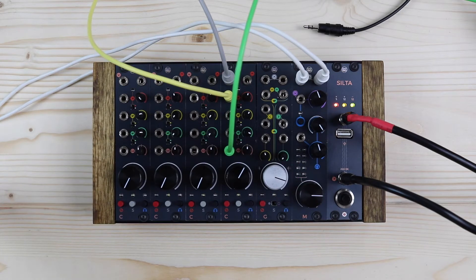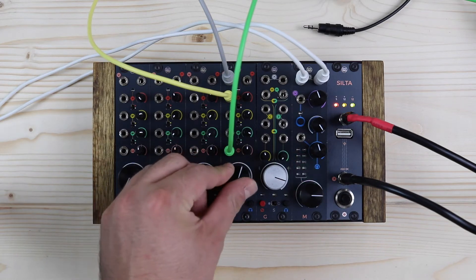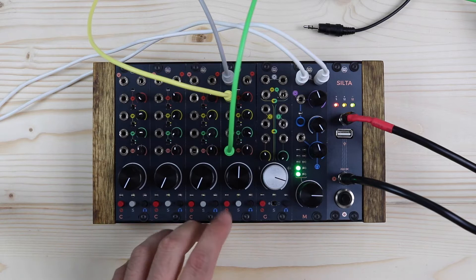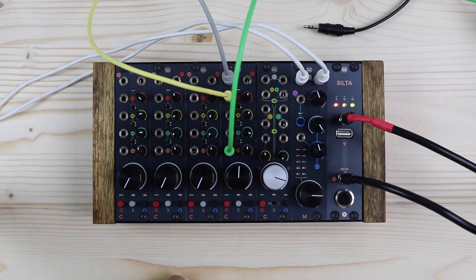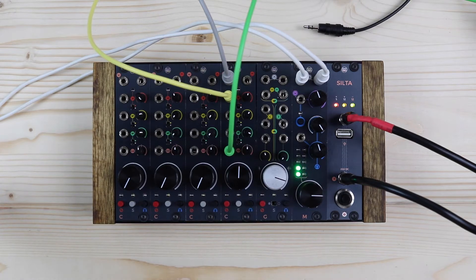Control voltage range goes from -5V to +5V, where -5 is left, 0 is center, and +5 is right. The big knob on the bottom is the fader and manages the volume of the signal which is sent to the group, as in any other mixer. The three buttons on the bottom of the module, from left to right, are the mute, the solo in place, and the PFL. The mute shuts down the main VCA, while the PFL only starts to work when a master module is connected. We will have a look at how the solo in place works when we talk about the group in a second.